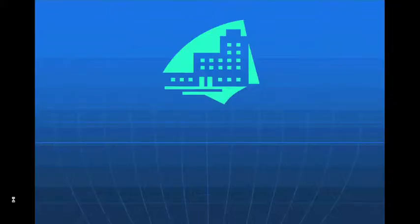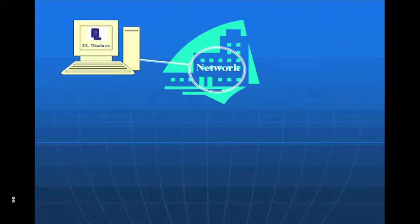over the net. So let me show you how a basic system is set up. If we take a building, for example, the building that we're in today doing the training, we have a network. From there, we're simply going to plug the DL Windows software into a PC that's connected to the network. We're going to take a gateway and plug it in. Now again, we can plug this in using a standard RJ45 wall jack. We can use a PoE, or we can use an 802.11. By the way, the two gateways, the 802.11, which connects over the Wi-Fi signal, and the Ethernet connected, come with AC adapters. So not only do you need the connection, but you also need 110 power.